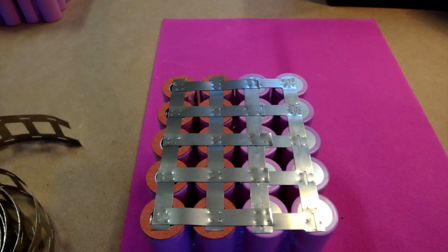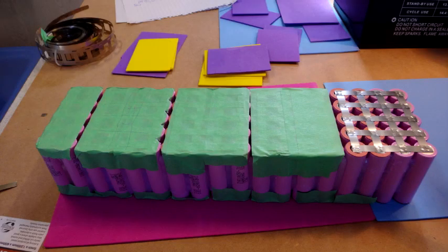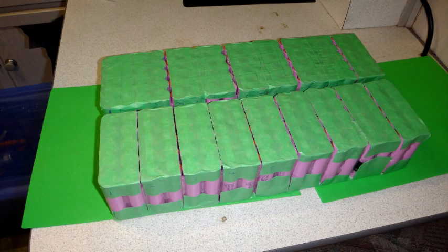Here's the result of my first attempt at spot welding two packs of 10 parallel batteries together to form the first series. As you can see, most of the time I used about four spot welds per cell. You have to be very careful on the positive end to make sure you weld directly onto the top of the positive terminal and not anywhere else. I'm starting to make good progress with the series groups, using green painter's tape to cover up completed welds to prevent accidental shorts. Here are the two layers — nine series each — finished and covered with painter's tape.